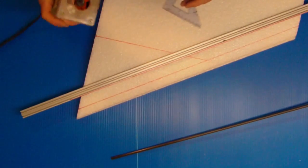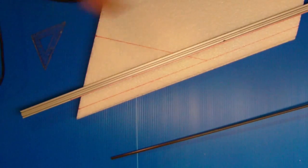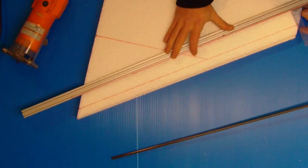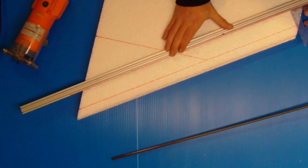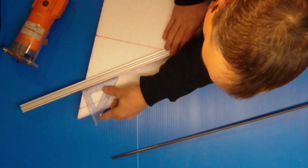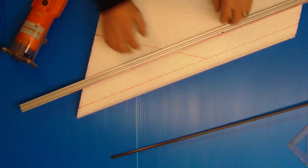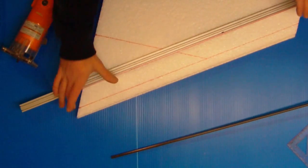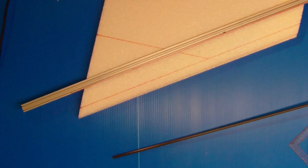Spacing on this depends on the position that you use the router, but on this router it's 1 3/4 of an inch. And you have two things you can do. I measure back 1 3/4, 1 3/4, just to make sure I'm the same. Now the easiest thing would be to, and I'm just showing one panel here, transfer your marks from this panel to the other panel, so that you're consistent. So my next step is routing this out.